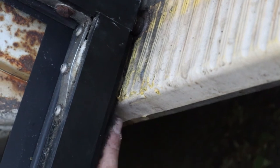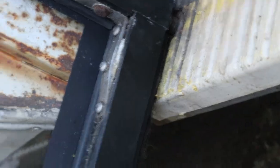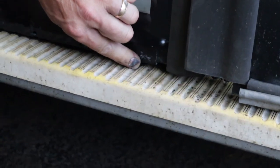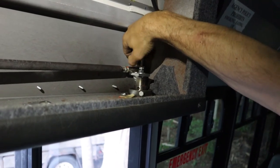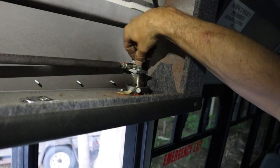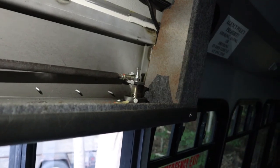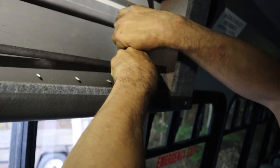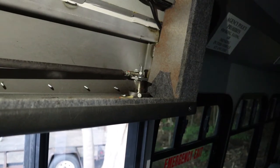That's about the gap I want. The brushes are rubbing against the plastic and it looks like it's going to be pretty good. The only real way to test it is to close the door — and it actually looks really good. Now that the door is adjusted to the proper height, I'm going to put a wrench on the top nut and a wrench on the bottom, tighten those two together so it stays where it's supposed to be, then tighten the final nut down. Once those are tightened, that door is not going anywhere.